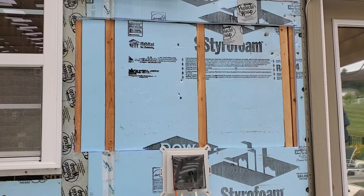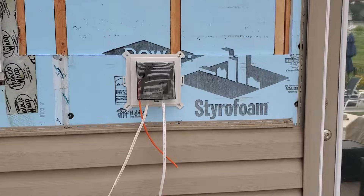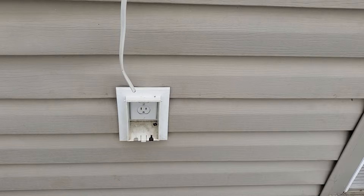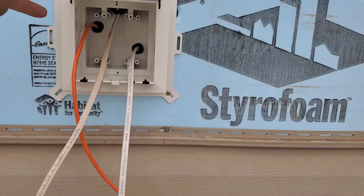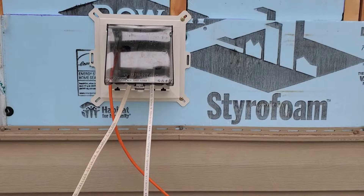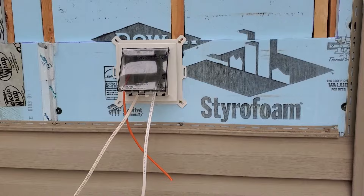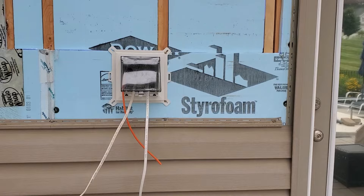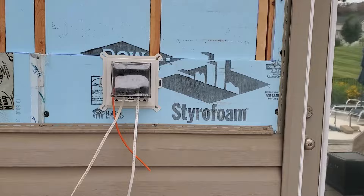So I cut out the foam and recessed it in there. I've already run an Arlington exterior box and tapped power off the outdoor receptacle already below me — since the power comes in from above, I cut it low, pulled the old cable through, ran an extension down, and rewired the receptacle. I also have Cat6 coming in here because we're going to run this with an HDMI over Cat6 converter. That way there's no issues in the future — a lot of times in-wall HDMI cables fail, and then you've got to go through the hassle of pulling another one. I had to cut the basement ceiling to get this cable up here anyway, since it's going to run off my basement receiver, which has a secondary output from the surround sound for another display.